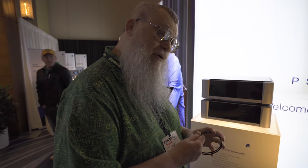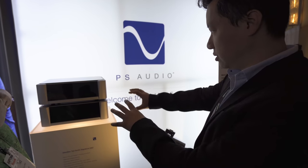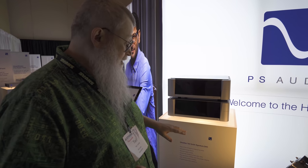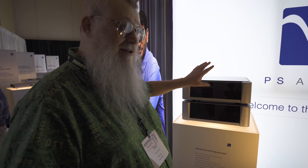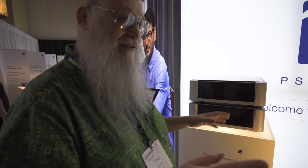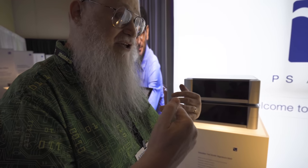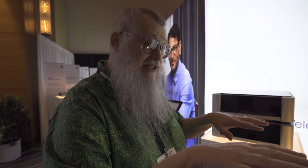In the analog box there are three layers. A DAC is digital to analog, so what's in the digital side and what's in the analog side? The analog box is basically what most people put in a chip — it's a glorified filter for the 11 megahertz DSD signal. It's a low-pass filter and that's its whole purpose in life. The digital box is just like the digital card in the DS: it takes in any digital inputs and you end up with the 11 megahertz DSD signal.